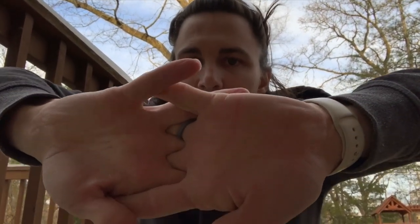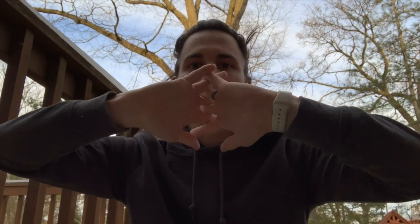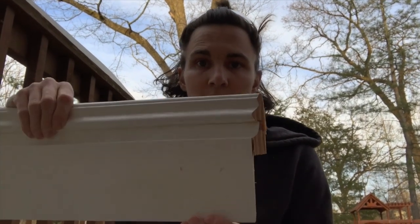You may be asking, why are we not just 45-ing it? Well, this material, as it gets bigger, it's a little bit harder to work with on an angle like a 45. The other thing is we're going for a connection like this — if you look at my hands here, my hands fit together really well like that. On a 45 with all these different lines and everything, they don't exactly just go together — you see those holes in there. So the cope really is the best and tightest way. It's the way that everybody who knows what they're doing puts molding together. One side is square, one side's on a 45 — not really a 45 anymore because it's going to go square and then all this is going to get cut away.